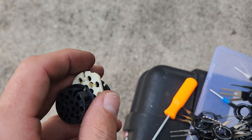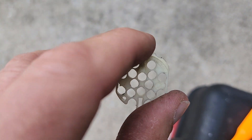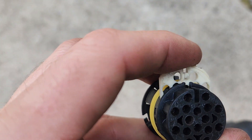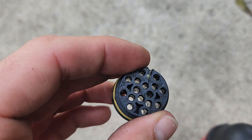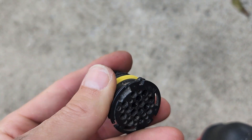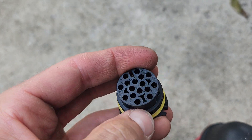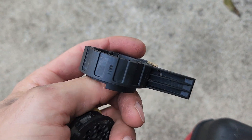All the wires and plugs go through this white clip. If you push on it once you have everything out, the clip comes out. See how the wires all go through there - it acts as a little lock to keep the wires in place. It slides in like this and clicks all the way in. Before you put your wires back in, if you're swapping this connector out, make sure that clip is in there first. Then push your wires in from this side and they'll lock in place, and then put it all back inside the ring.